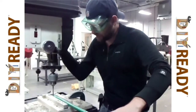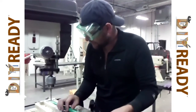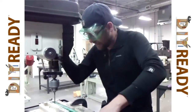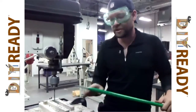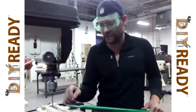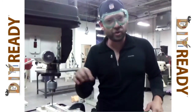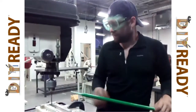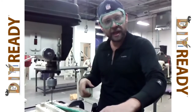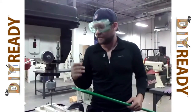We're drilling this with a nice drill press. But if you don't have a drill press, don't worry — you can do this with a hand drill. Just have to mark your spot, and it helps if you do a tap, which means take a nail or something and hit it with a hammer so it puts a little dent there. That way the drill bit doesn't travel. Make yourself a little jig, set your bar in there, and just drill with a hand drill. This can be done two or three different ways — this is the easiest.